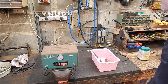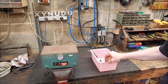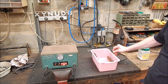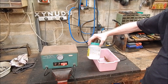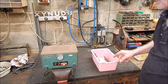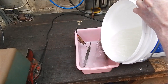Alright, so I've got it rigged up now to do the electrolysis. Got the battery charger here, just an ordinary 12-volt battery charger. Plastic tub. We've got the file on the negative and a bit of old scrap steel on the positive. We've got some washing soda and some water. Battery charger's turned on — I'll tip in the water and add the washing soda and you're about to see it start to bubble.